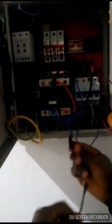But the connection poses serious risk to the motor since there is no functionality of voltage monitor and contactor. So in this case, we are trying to test if there is a voltage in the wire. Because the system was connected from the supply directly to the machine, we are to disconnect the direct connections and put it in a proper way, so that if there is a surge or incomplete voltage, the voltage monitor at the top will control it so that it will not have any damaging effect on the calendar machine which we are about to power.